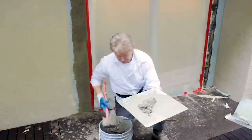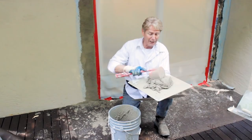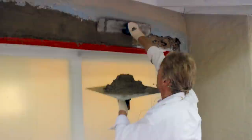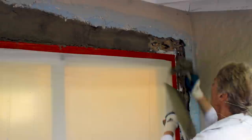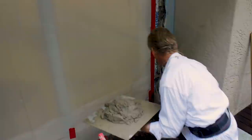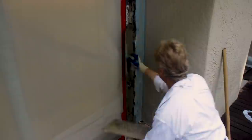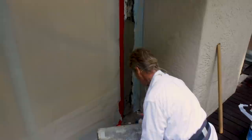Learning how to do things yourself has its benefits. I started plastering 40 years ago. This is my last scoop with this mud here — Jay and Dan are going to mix me up a little bit more so I can finish showing and explaining how you guys can do this stuff yourself. Moving on — another bucket of Rapid Set here. If the mud is a little bit stiffer or richer, it hangs a little bit better.